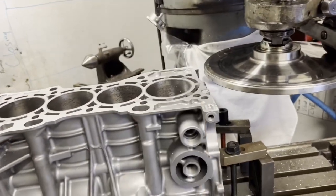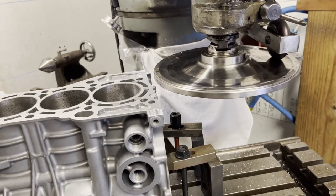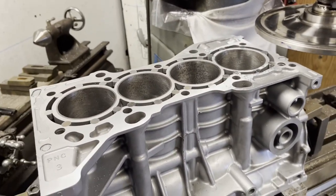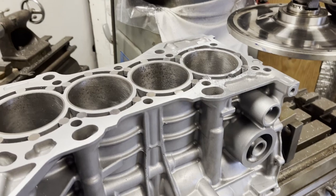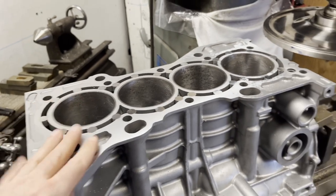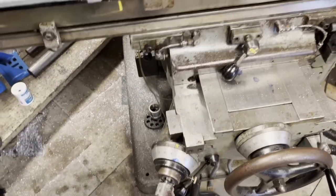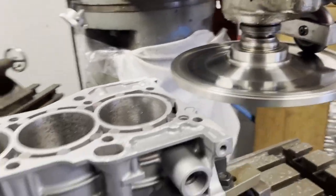I think I have it kiltered barely, barely, barely. Before I didn't have that set at all. I'm going to cut one more pass at one thou — this was a two-thou pass which is too high for a final pass on this setup, maybe even two and a half to three thou. This is a test block; I'm out about eleven thousandths on the deck total, mostly from playing around with the bad carbide cutter to get the chatter and bimetal deck issue into the conversation.